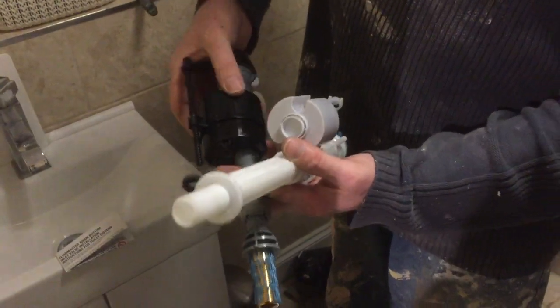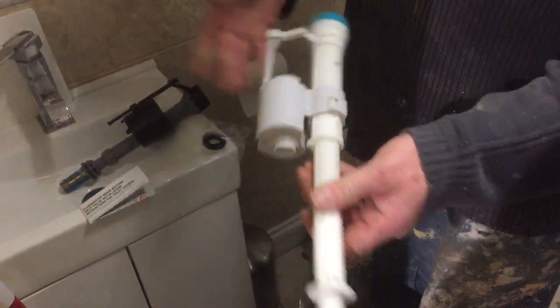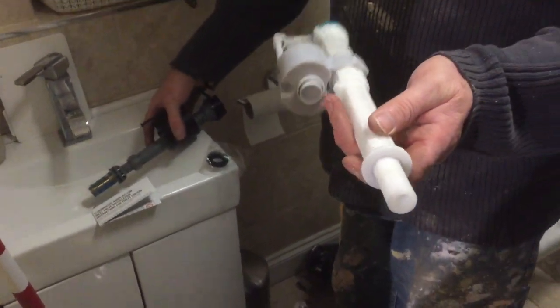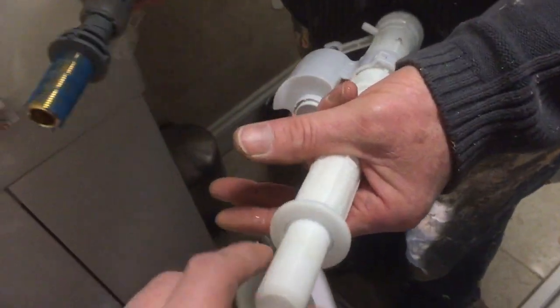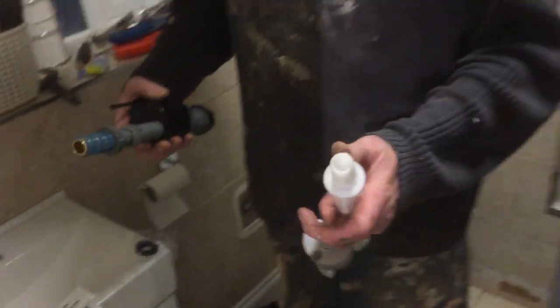This bit pops up and down and lets the water in — same thing. The big difference is at the end: the Ideal Standard one has a plastic thread, which is half-inch and comes with the standard toilet. The Fluidmaster has a brass thread at the bottom. This one is a lot more substantial than the plastic one, and plastic shrinks and contracts in cold and hot weather.